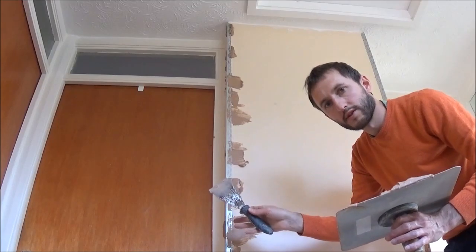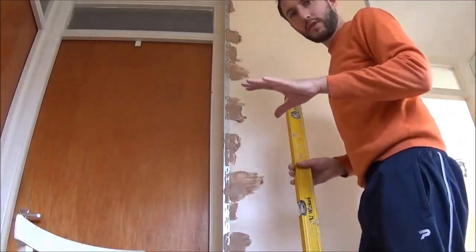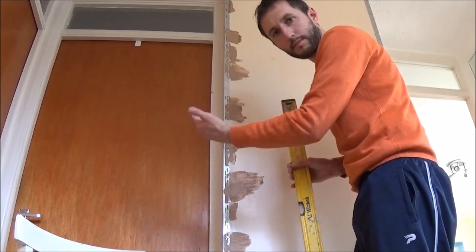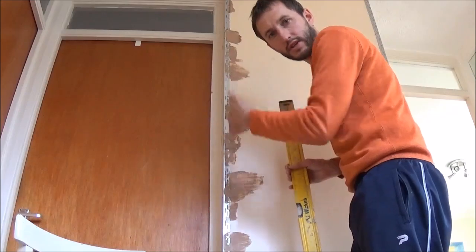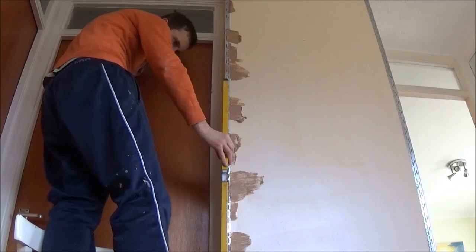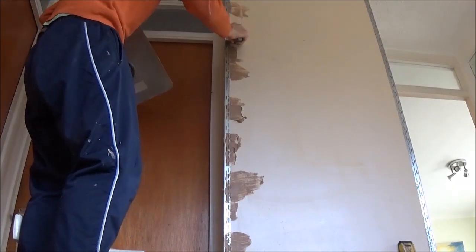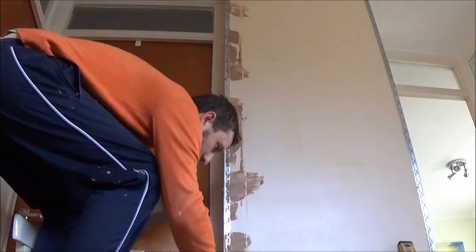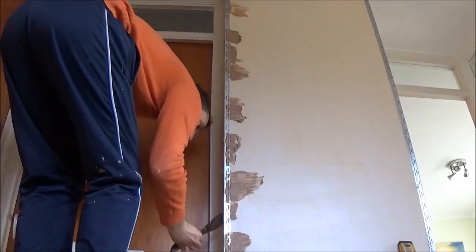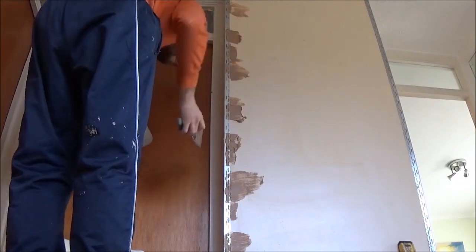Now when you've done this just do the same on the other side. Don't forget — importantly — go over this with your spirit level, and if you need to make any adjustments while the plaster is still wet we can manipulate the bead in and out to get it level. Then just run your trowel all the way down the bead to make sure you haven't got any excess sticking over the corner bead. That's how to attach angle bead using plaster. For more DIY how-to household tips and product reviews please watch my other videos and don't forget to subscribe.